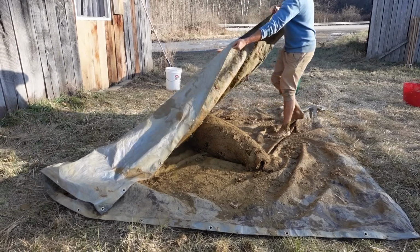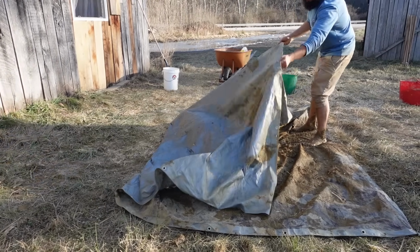Like a manatee, yes. In this barn apartment we're renovating, there are existing thin wood walls. So we framed those out with 2x4s and then added some thin wooden strips over top called lath. When we nailed the lath to the 2x4s, we left about a 1/4 inch gap, and this is important because it's critical to how the plaster stays on the wall. As you're applying the plaster to the wall, part of it will squeeze through those little gaps, and then it'll slump down and harden, forming almost a hook that will hold the plaster to the wall. This is a feature called key.